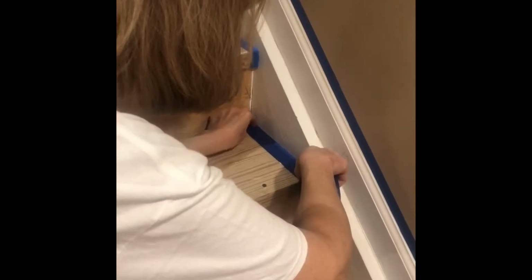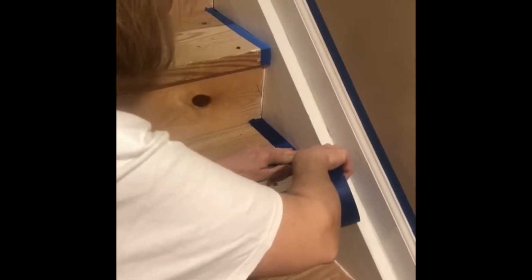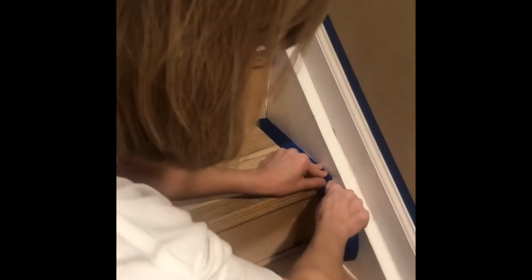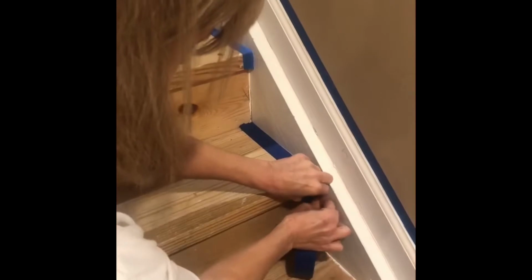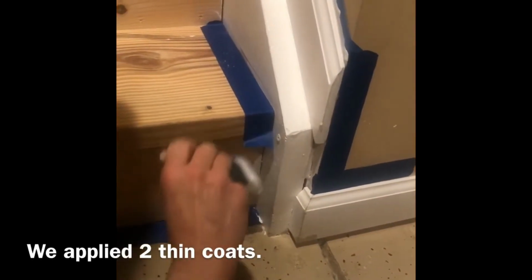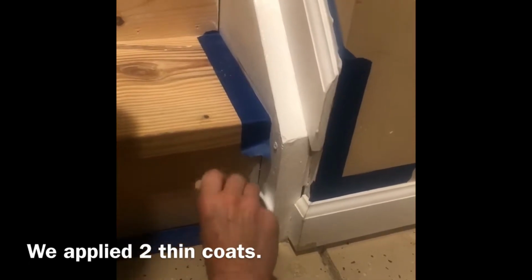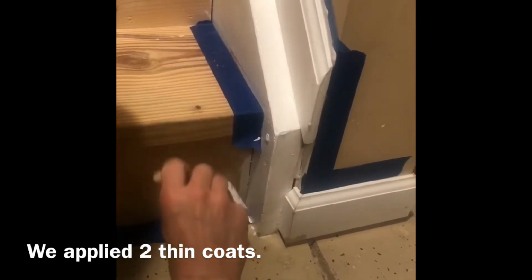If you plan on repainting the skirts on the side of the stairs, you will need to apply tape to the pieces of wood. This will allow you not to get any paint on the wood so that it will not show up under the stain. After you have applied tape to all necessary areas, you are going to want to apply the paint to the skirts. Use the sponge brush to do this.